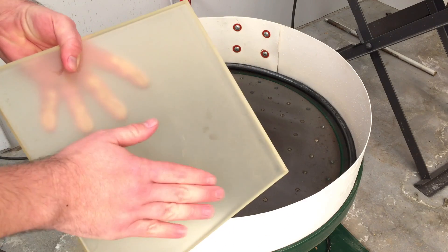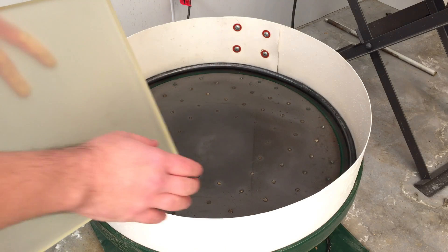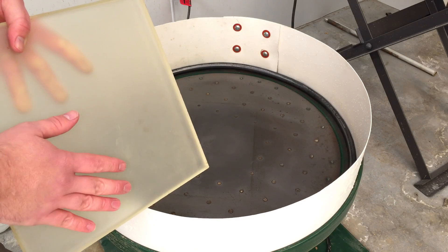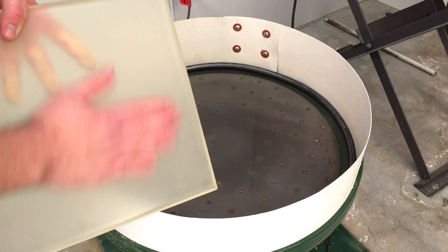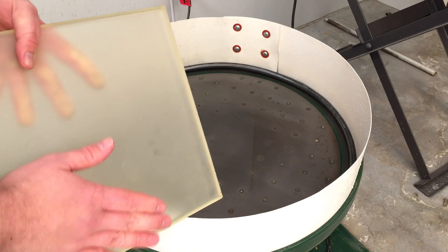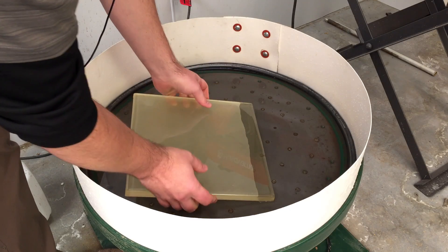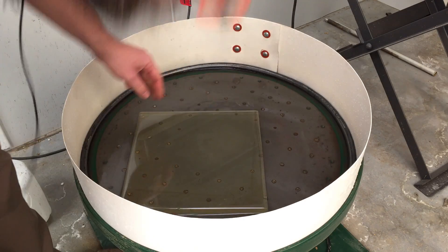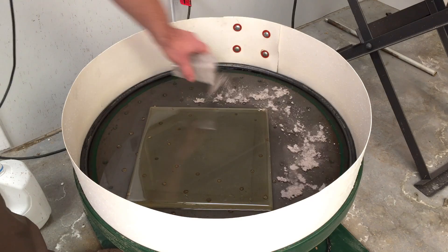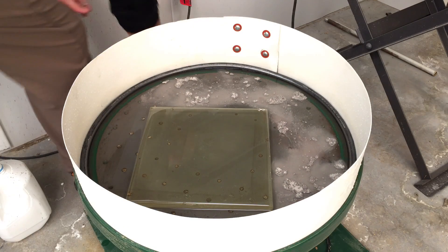I could probably take this surface left over from the 220 grit, put a felt pad or an LP66 pad in my Reciprolap with some cerium and accomplish a polish. But we also have another stage that utilizes garnet to try and clean up this surface a little further to really prep it for a polish. So we're going to use a little bit of garnet in our Reciprolap and let this run to see how much of a difference it makes on this surface and how quickly it'll increase our polish. It's going back in the Reciprolap with a little bit of garnet.